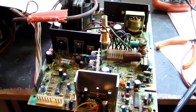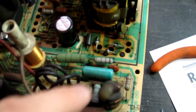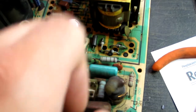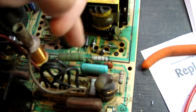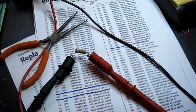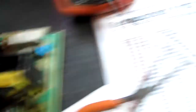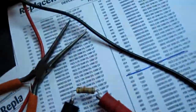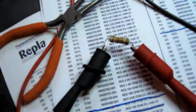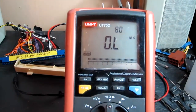So we're looking at the monitor chassis on the bench. I thought it'd be a good idea to start going through some of these larger high power resistors, as they're a common failing point — they either fracture from vibration, or because they've got high current going through them, they can fail before the smaller low current resistors. I've tested about five resistors, checking them off on the parts list, and I came across this one here — R120 in the power supply section. It's a 68K ohm resistor, and my multimeter says that's infinite resistance, so that is dead.